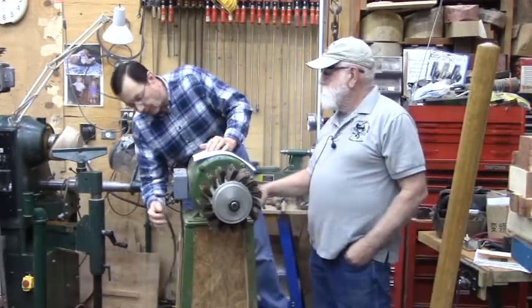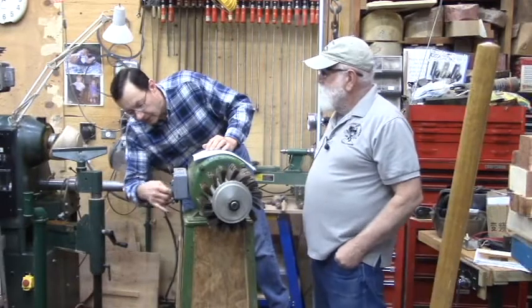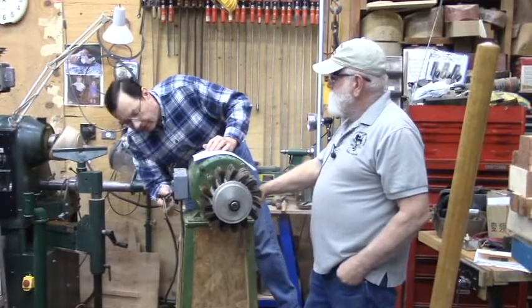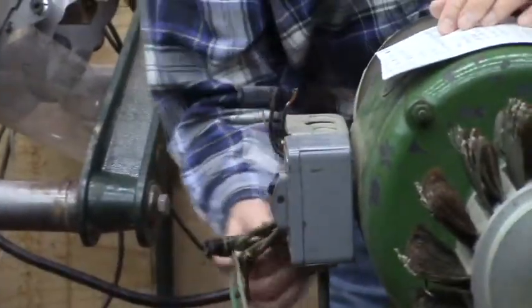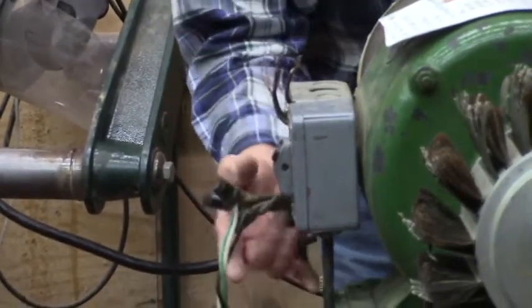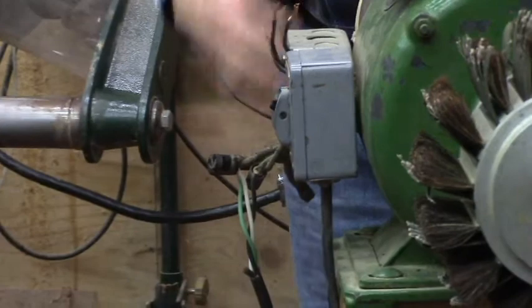if you can get a chance to look at some of the wiring, this is a good example of wiring that's pretty worn. You see some of the threads, there's some tape in here, and you can see some junctions have been tied on. But if you'll notice, these wires are fairly flexible. If you get one that's been overvolted and burnt, these wires will get crispy. That doesn't mean that's an absolute no, but that'd be a warning sign to me. I have found some things with crispy wires that you can repair, but you want to be real careful about that. And the price ought to reflect any damage like that you find.